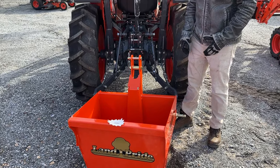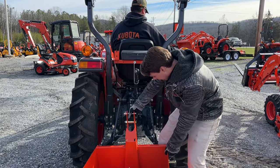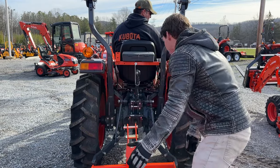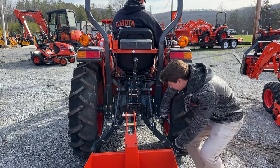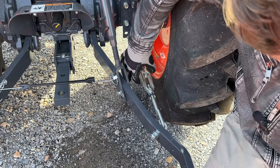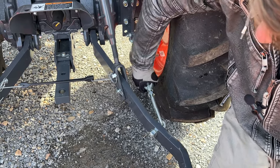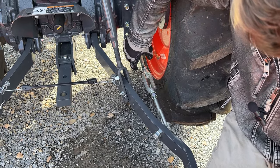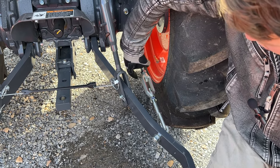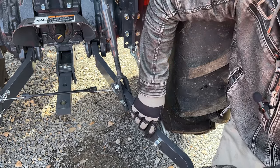You have adjustments because a lot of times your arms are too far in or they're too far out. We're going to have adjustments with what's called our stabilizer arms. These silver rods here are called stabilizer arms, and these are what's called a turnbuckle. To adjust this, you turn this buckle and you see that arm moving in, or you turn it the other way and that arm moves out. You have lock nuts on here, so once you get to the right space you can put pressure on these, lock them into that turnbuckle, and now it won't spin and it locks so it's not going to move.